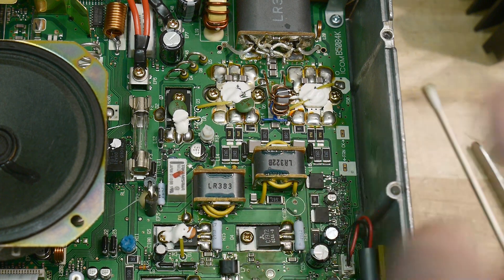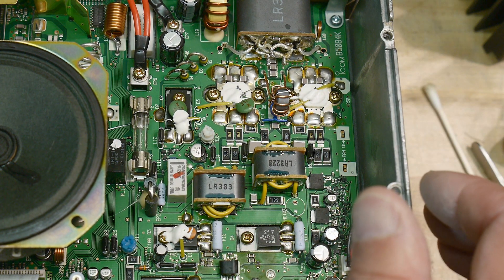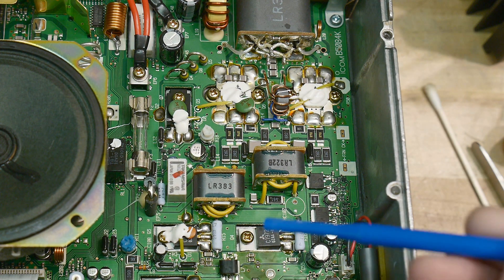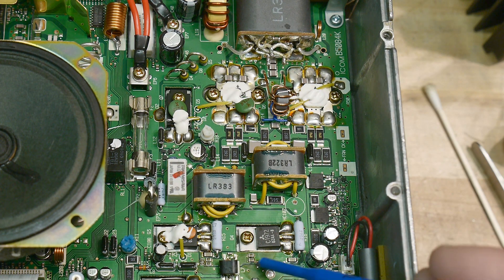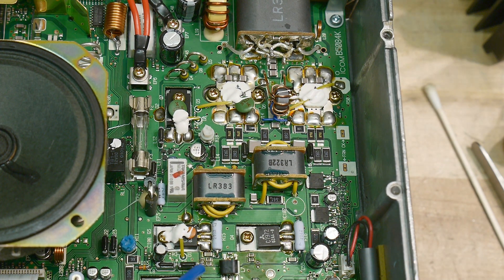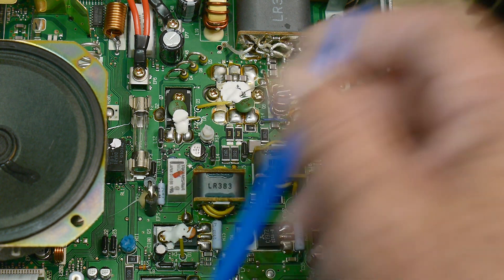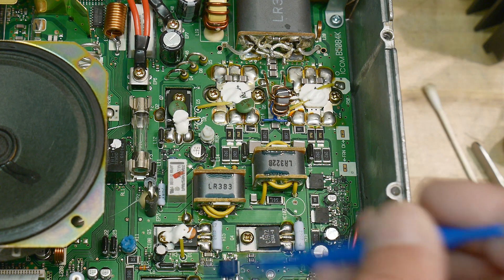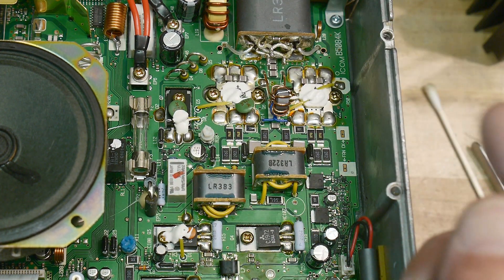Maybe it's because they're in circuit — maybe they need to come out of circuit, and we'll probably need to eventually do that anyway. So what I found was the resistor that blew. These two 1 ohm resistors seem okay. These two 1 ohm resistors seem to measure 100 ohms. And this 47 ohm resistor measures open. Lots of interesting things going on.